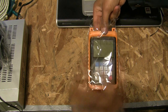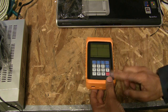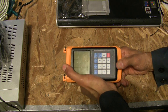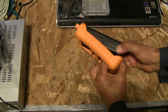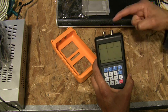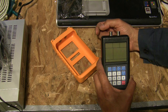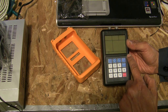We're going to plug in the battery and show you how that's done. Remove the plastic covering and set it aside. To open up the meter, this plastic cover is for safety and protection. Pop this little plastic from the bottom side open like that, pressing at the back with your fingers, and gently remove it. Your meter has two inputs — the right-hand side goes to your satellite, and the other can go directly to your satellite receiver so you can preview what you're doing, and your satellite receiver can also power your meter.